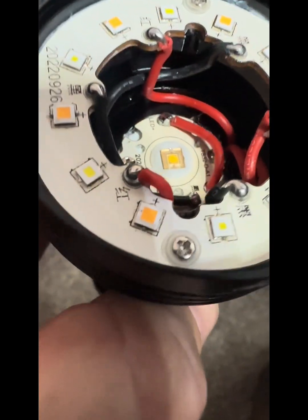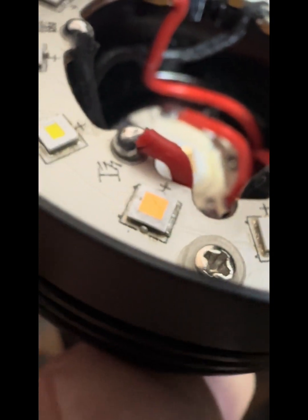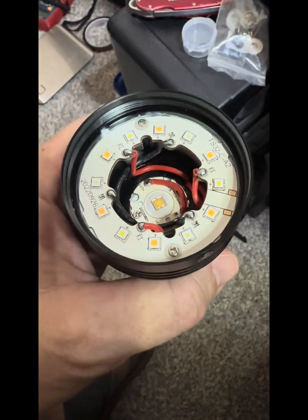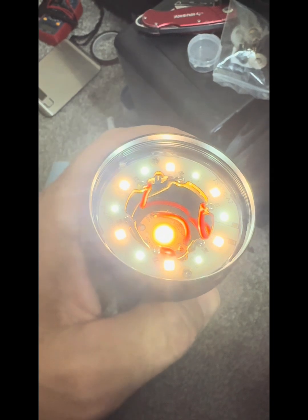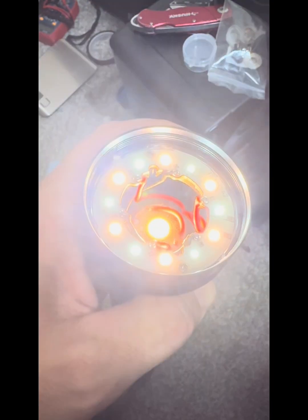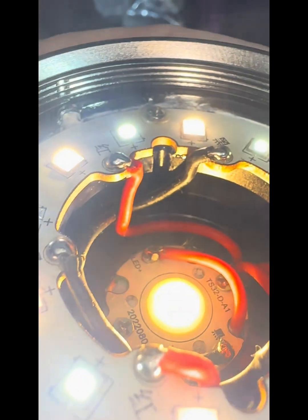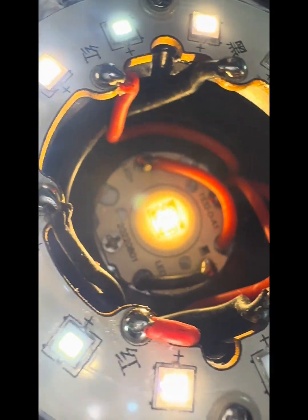You can see that solder joint - see how high it is and how it's rubbed the silicone - whereas these ones are more flat. I didn't even think about that, but when you put it back together, that's what I think is causing the problem. Because when I have it all apart it looks just fine, everything works fine. It's just that joint. So I'm going to redo all these, make sure they're all good, and try to put it back together.